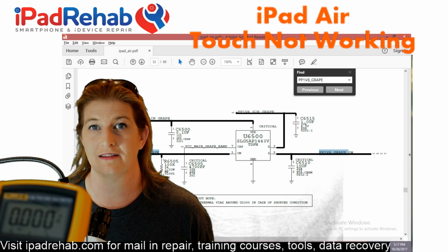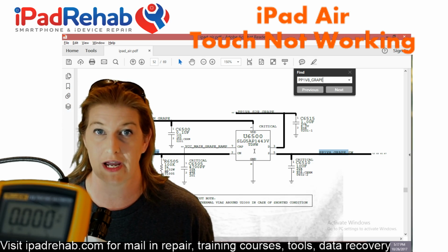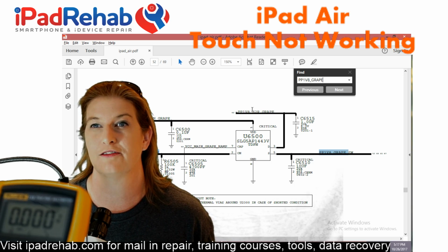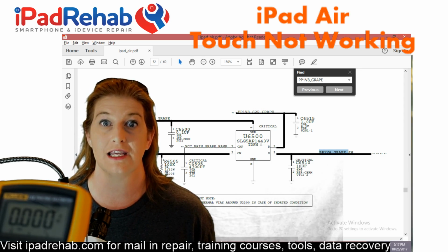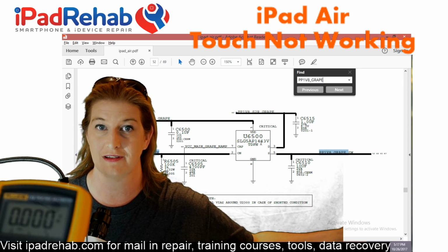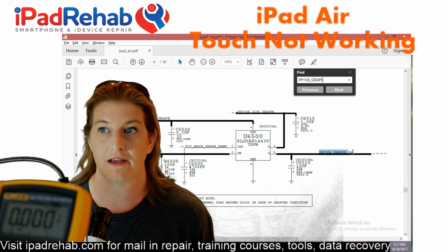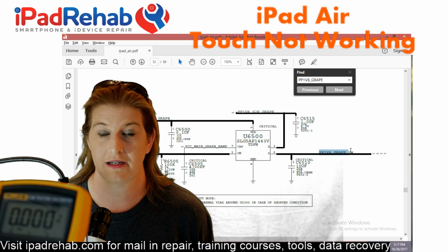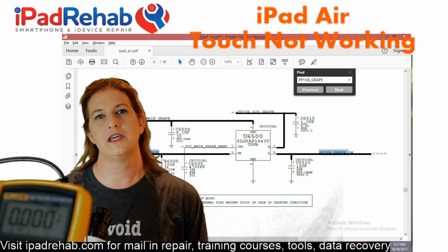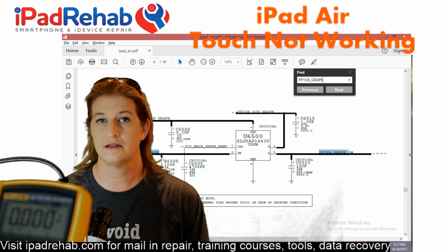Our guess is that this chip is powered on by VCC main grape, which is present. And our guess is that the input is PP1V8S2R grape, that if the signal ding dong from PP1V8 grape is present, which comes from the PMIC, then it will shoot out PP1V8 grape SW. And it's not doing that. So now we can ask a question: why would the PMIC not output that PP1V8 grape signal?